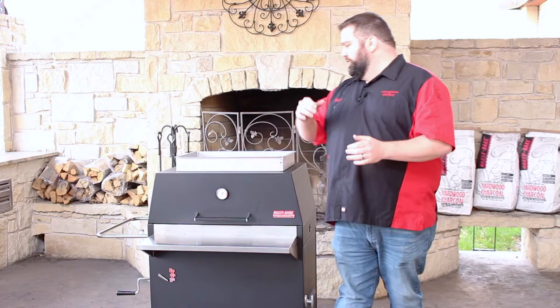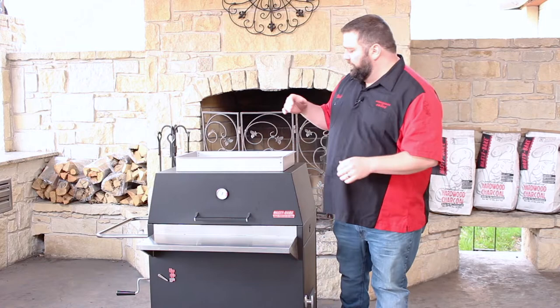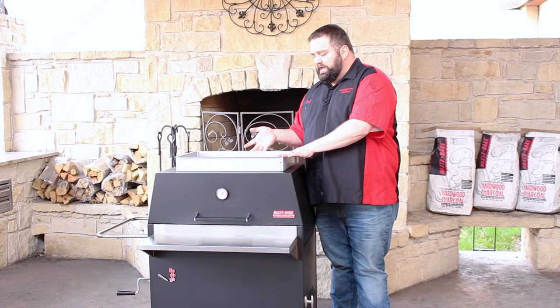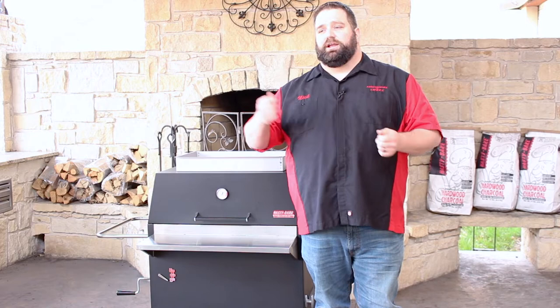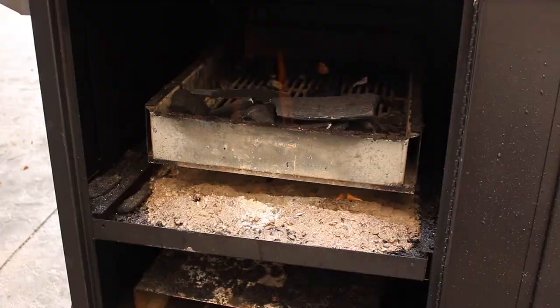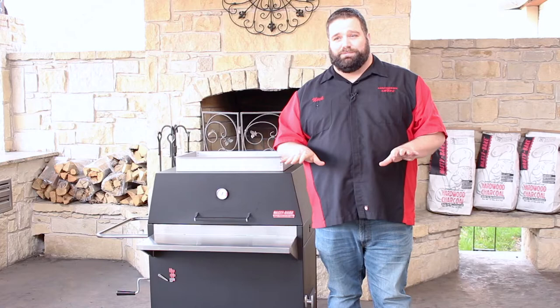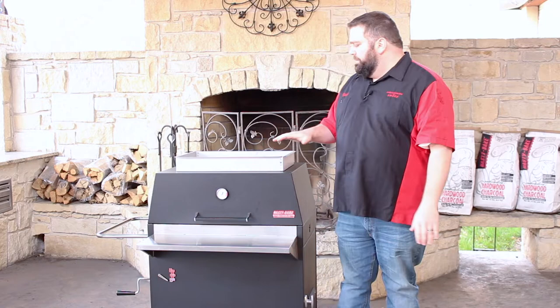When building your fire, make sure you're using the appropriately sized charcoal. One thing to be aware of when building a charcoal bed is charcoal powder — the dust that breaks down from charcoal as it gets smaller and gets thrown around in storage. That powder can build up and actually snuff out your fire. After you dump the charcoal in and consolidate it to half the box, give the rack a little shake to get the charcoal dust down and distributed into the ash pan. Having a layer of charcoal dust in the bottom of the ash pan is actually beneficial, and it also allows room for air to flow through your charcoal without getting snuffed out by powder.